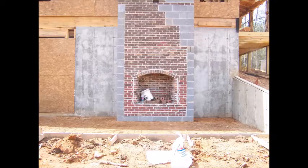The fireplace is a dual fireplace — one on the patio downstairs where the walkout basement is. This one has the iron kettle racks in it, so they can cook out here and do things on the patio. Everywhere you see the cement, it will have veneer stacked stone in a gray color on it. This will also have the deck above, which will keep you somewhat dry and keep the sun off you out in the back of the house.